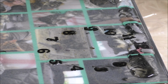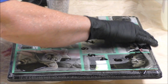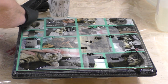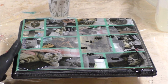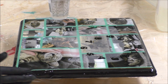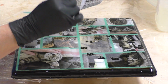When it was hot. All right, so now I'm just going to pour this on and cover the rest of it. I took a 120 sanding disc and went around these edges a little bit, simply because it seemed to me like it was so rough, even with the penetrating epoxy and the first coat of Total Boat. I wanted it a little bit smoother. Yeah, that MDF, when you're putting any paint or finish on the edge, it is literally like a sponge. It really soaks in.